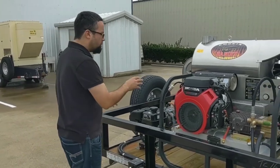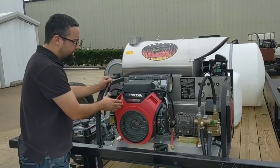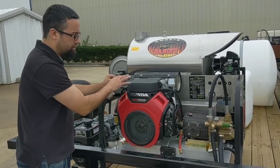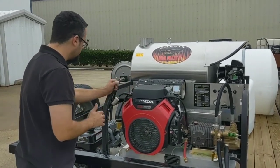It has a hot water pressure washer. This is going to be a 3,500 PSI, 8-gallon-a-minute unit. I actually run these at 3,200 at 8. I've learned that 3,500 over-revs the engine. I like these at 3,200 at 8 — just personal preference.